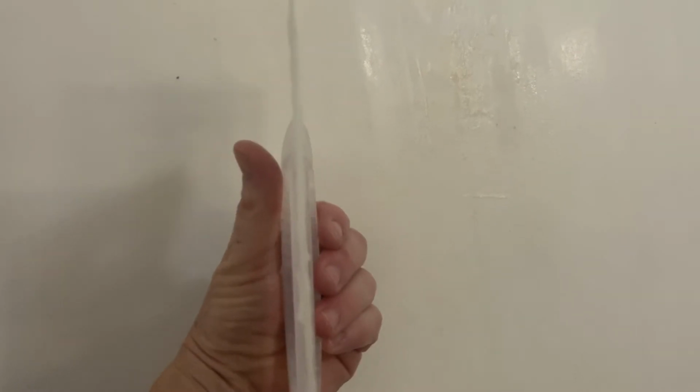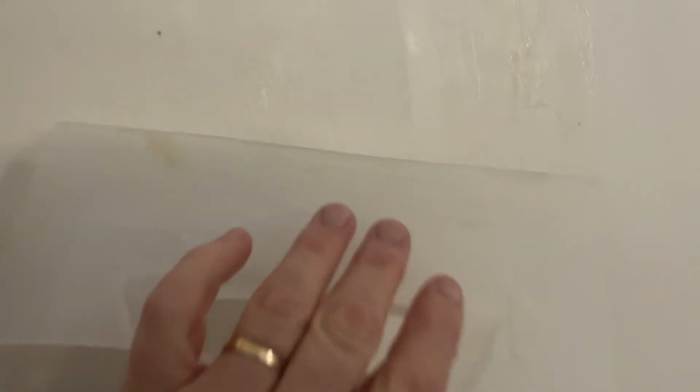I just removed 2 layers of wallpaper from the wall that you're looking at. And in various places you will see a yellowish tinge. For example, right here. What you're actually looking at is residual paste. If you take a scraper, and I don't mean a metal one, I mean a plastic one, if you take what's called a paint edger, I got this at Harbor Freight, let me show you how easy it is if you wet the walls down sufficiently to get this residual paste off. Watch this.